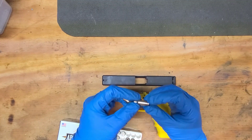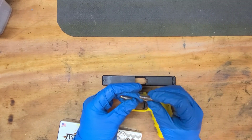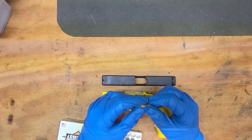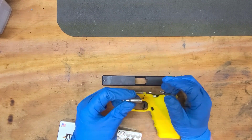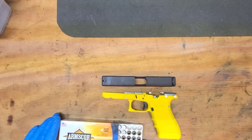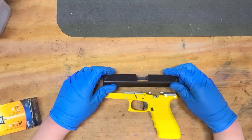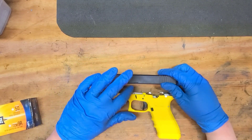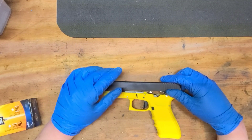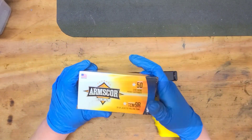What was happening is the brass — you can see it's bulging. As it's being fired and the pressures are released, it's expanding the brass. The tooling marks in the chamber are gripping the brass, and every shot I fired out of this with the 22 TCM 9R barrel would either just stay closed, or the brass would remain in the barrel, the slide would go back, grab another round, go forward, and jam trying to enter a chamber that still had brass in it. So I lost none of the brass.